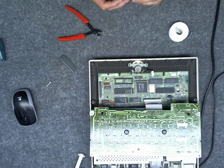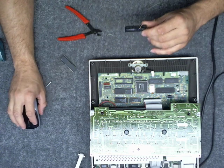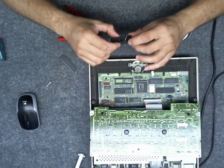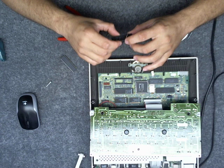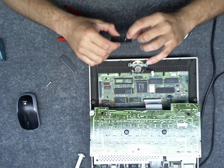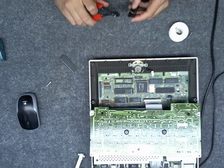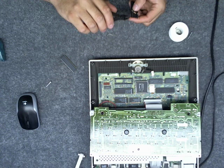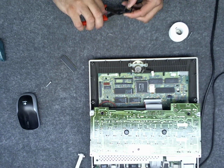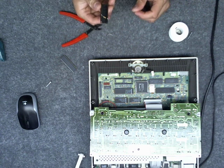That's the little modification that needs to be done. Just to make sure I did it right — pin 8: 1, 2, 3, 4, 5, 6, 7, 8. Yep. And pin 36: 1, 2, 3, 4, 5. Yep. Now the next thing is to cut out pin 1 of the microprocessor — that pin will not be going into the circuit anymore. So cutting out pin 1.